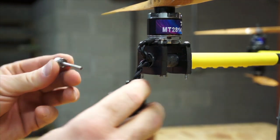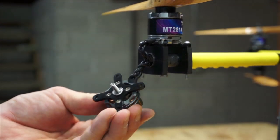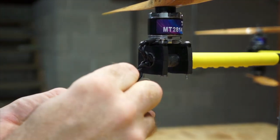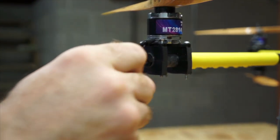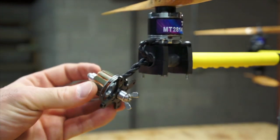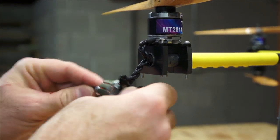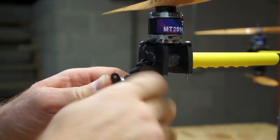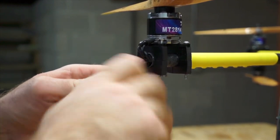We slide one bearing up against the block and put it in place on the motor. We put our other bearing onto the bolt, then put our other block in place — again, we want the recess side up against the bearing. Then we put the wing nut on. The bearings are nice and square. I use a three millimeter Allen wrench to keep the bolt from turning and just tighten the wing nut. Little by little, those bearings are getting pushed into place. I know they're all the way in because the wing nut is going to stop turning.